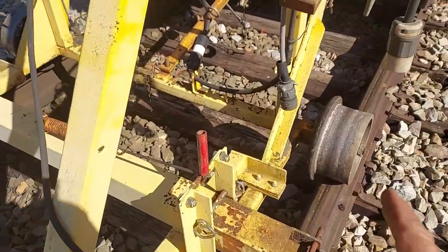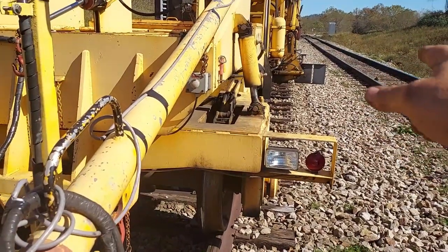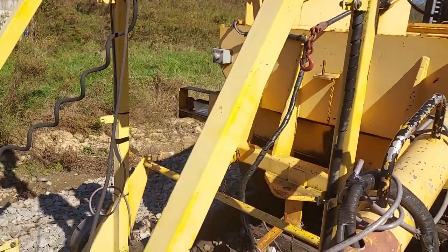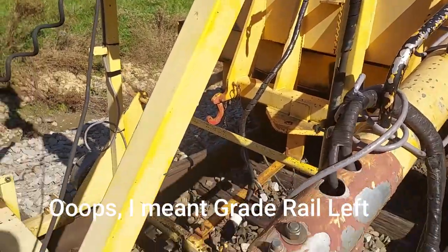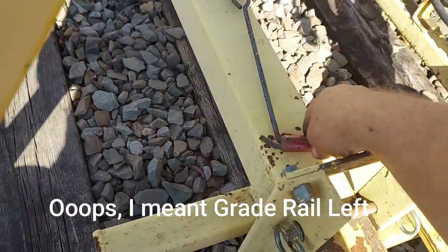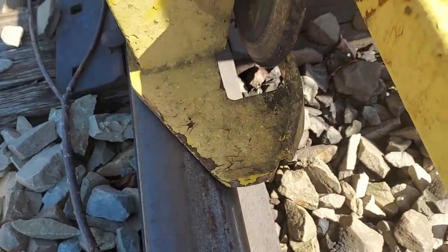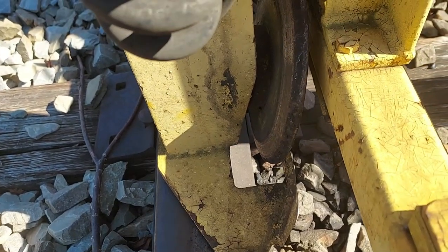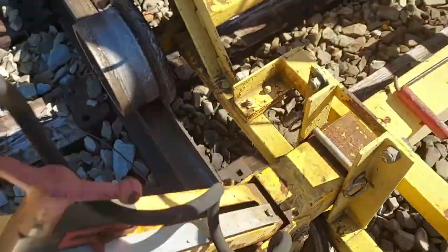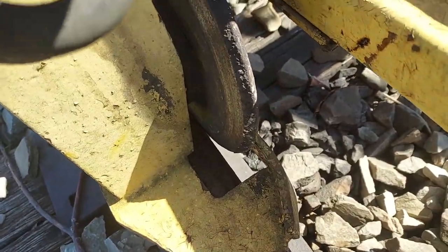This is my light carriage, and what we want to do is have the light carriage, the mask follower, and the rear rail follower receiver all referenced against one rail or the other. I have it selected for grade rail, so that means everything's got to get shifted over to hold against that rail. This is how I do it — it's mechanical. We shift this wheel over against this rail and it holds it there. That's very important.